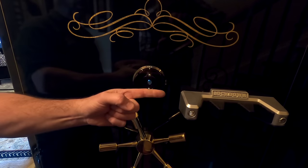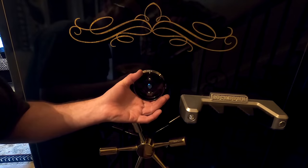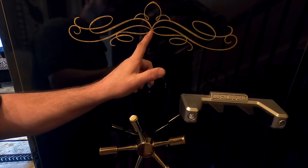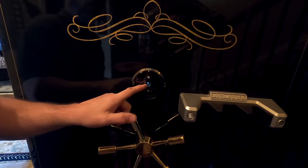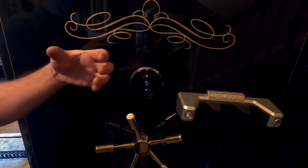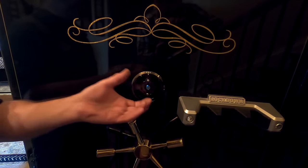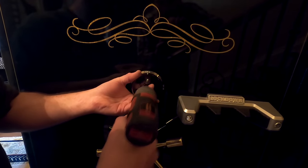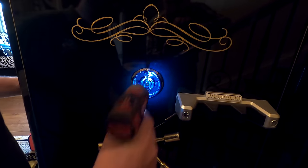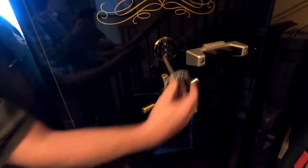What we did was move it over a little to the right to try to line it up, and it may be a little off center from here, but it's going to be very hard to see. The platform on the back that has the tapped threads for the body is going to determine where our spindle needs to be, so we need to line the faceplate up with that hole. And that lines up with that slot.